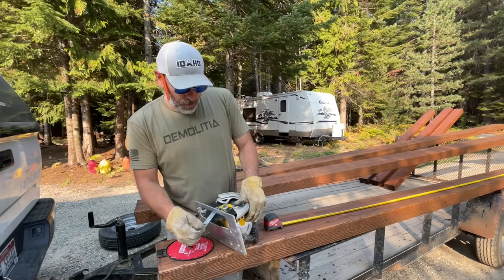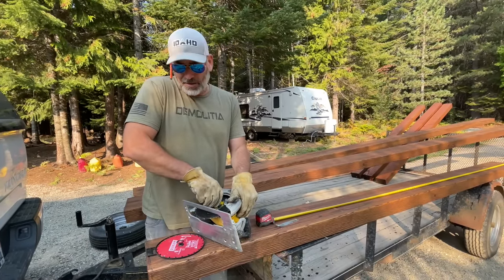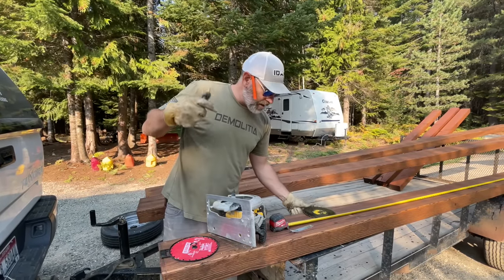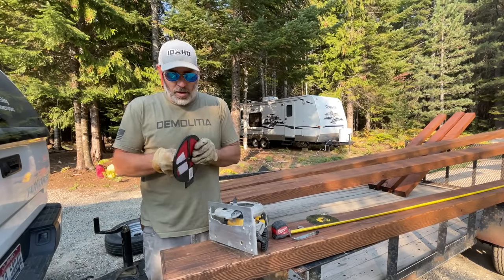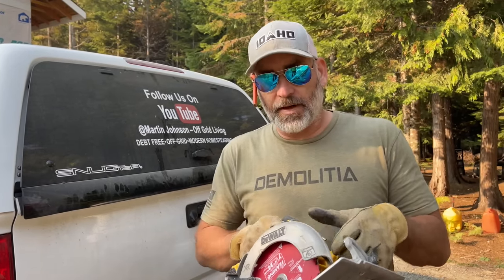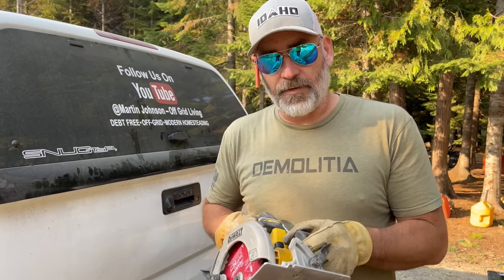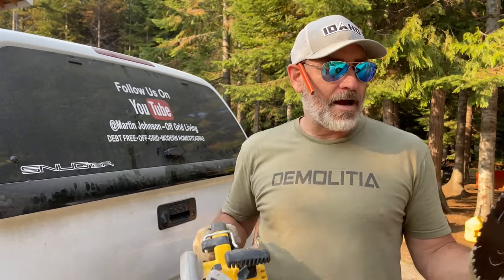We're going to put a new blade on because new blades are nice and sharp and cut nice and fast and clean. We've got to cut these beams - surprisingly, they don't come square from the factory, it's way off square. We're going to square up this end, take it over there, put it on the brackets, then mark it where it needs to be cut for length - that way it'll be directly above the post. I was watching a YouTube channel - I think it's called The Farm Project - and he found that the Makita skill saw blade is the fastest and sharpest against all of them. The Diablo is kind of in the middle, but if you're cutting through nails the Diablo did pretty good while the Makita really suffers.